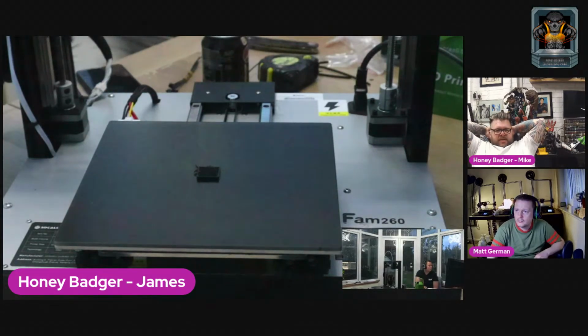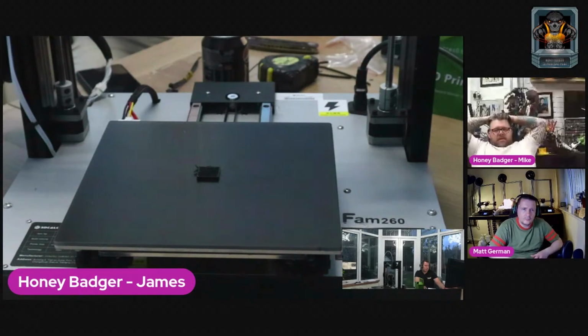I want to see. Right, get rid of that. So a 0.2 layer height with 20% infill, 210 on the material, 60 on the bed. Speed is 100. Retraction and cooling I'll leave as they were. Build plate adhesion, everything else, just make sure supports are off. For build plate adhesion, we'll do a skirt. Slice that.